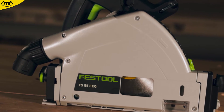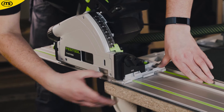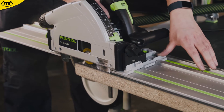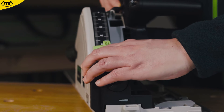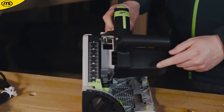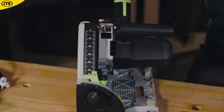As Carl explains, this is Festool's flagship machine with well over one and a half million products sold — the market leader, the inventor. So why the TS55? It's really easy to make accurate clean plunge cuts thanks to the clear identification marks. When working with the guide rail you get a 50 millimeter depth of cut, and it's really easy to set exact depth settings using the depth setting guide on the front, with angles from minus 1 to plus 47 degrees.